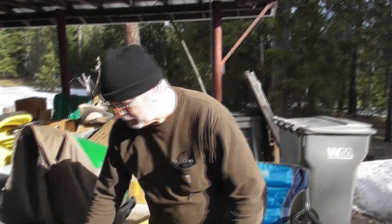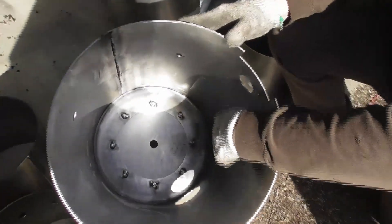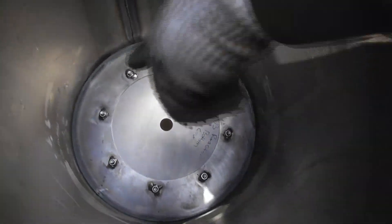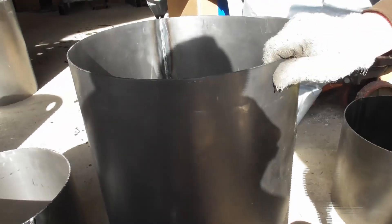In the bottom housing, we've got the bottom plate in. You can see here, we've got the nuts welded to the bottom plate. We've got a good solid weld around the outside edge and everything's lined up. We've got good weld, good penetration on this. This bottom plate is extremely critical because this is the base, the foundation for your whole reactor, and the reactor is the most important sub-assembly of your whole build.